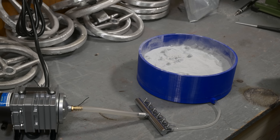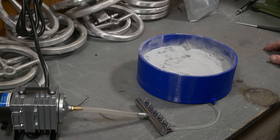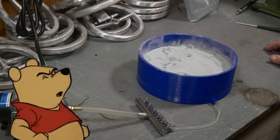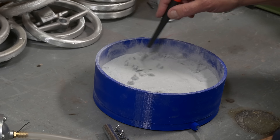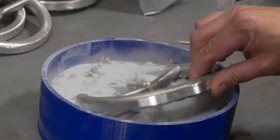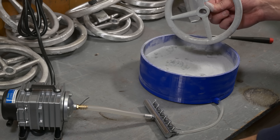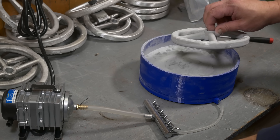That's not good. I think we have to go back to the drawing board — we're not getting an even distribution. It's working well in one spot right in here, but not across the whole bed. This might be a case of having too much powder for the amount of air we have, or I may just need to redesign the air grid.